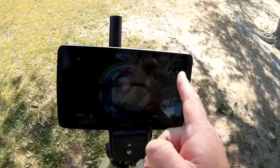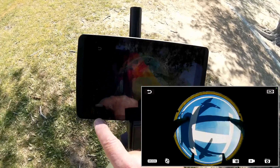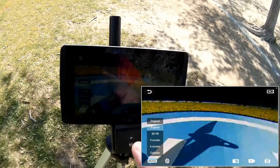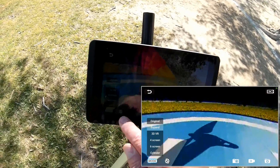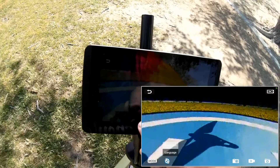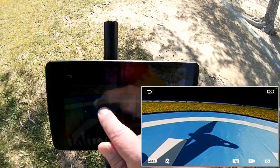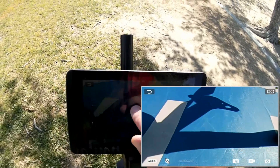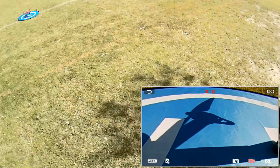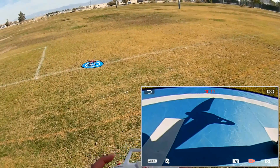I have the MJX Go app started. Notice this panoramic image we have here on the screen from the belly of the aircraft — we're seeing 360 degrees around it. You can select different modes in the lower left corner; we're going to select Expand for the flight while I'm flying. Keep in mind it will be recording in panoramic mode regardless of what mode we select while viewing. I am also going to be selecting higher resolution. Going back to mode — Expand — and we're going to be viewing forward of the quadcopter and a little bit down. I want to start recording. Recording has started, so let's go into the air. Putting my glasses on so I can view the quadcopter while flying, arming the motors, and taking them to the air.